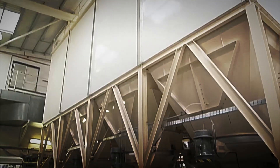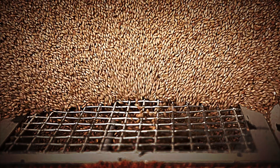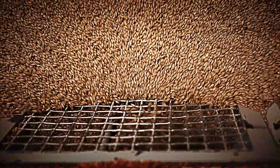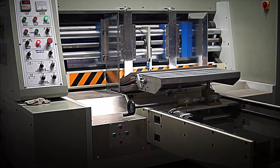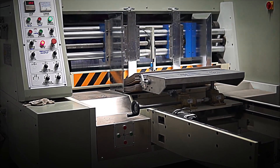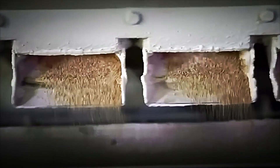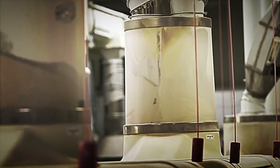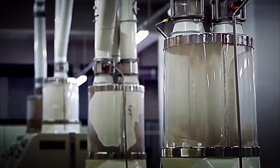The heart of the milling process consists of a series of hardened steel rollers, known as primary and secondary. The wheat is subjected to progressively higher pressures to crack the husk and release the endosperm. Primary rollers perform a coarse grind, while the secondary and tertiary rollers refine the particles until they form crumbs that, after sifting, become flour. This white powder then passes through nylon sieves of calibrated mesh to separate the bran and germ, which are returned to the milling system to extract every last bit of starch and protein.